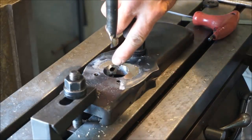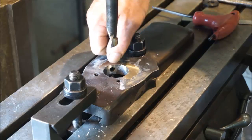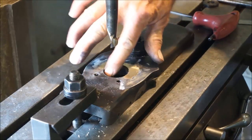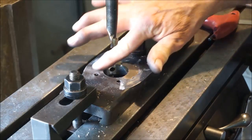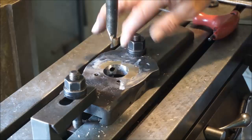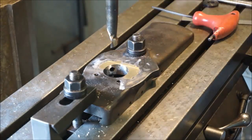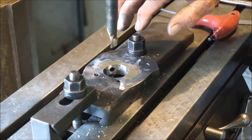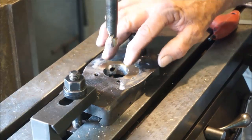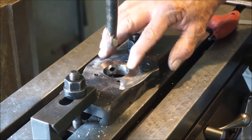I'm happy. Look, I've got that brass all the way out to the bore, all the way where we scalloped it. Got a nice sharp edge up here at the top. We're going to have material all the way around the hole so we don't have any voids in there. And we don't have any stress rise areas that's going to want to be a weak point of pulling this away. The braze will be secure enough in this part here to operate as it has been for its whole life already.